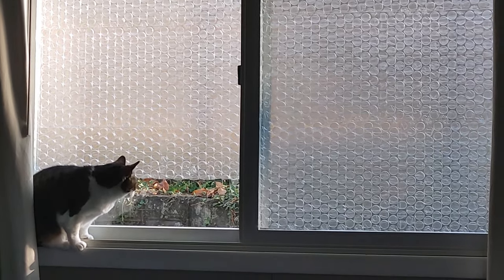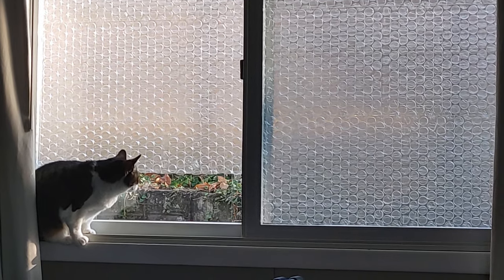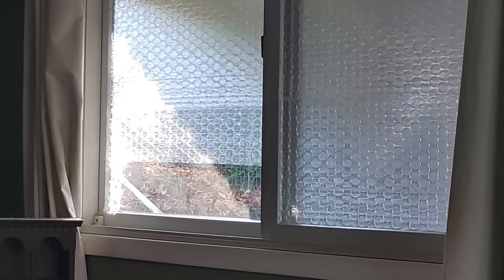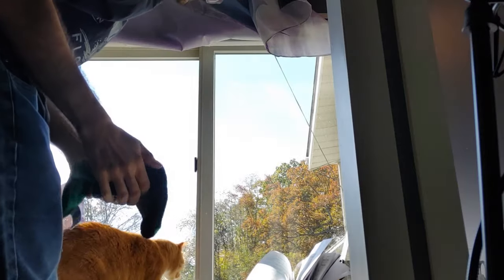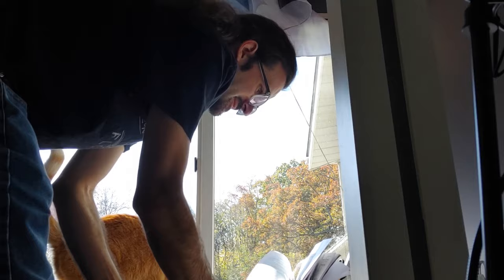Things like sheet window plastic do not insulate well from temperature exchange or conduction, but it does prevent air exchange or convection. It can dramatically increase your heating bill if you are constantly having to heat fresh cold air from the outside. However, I would speculate most air exchange could be taken care of by caulking, leaving little point to use temporary plastic sheeting.